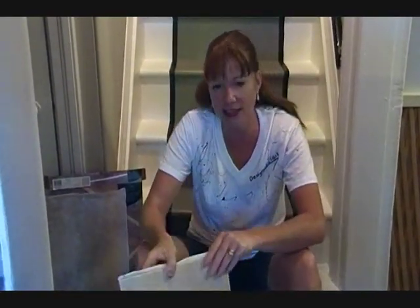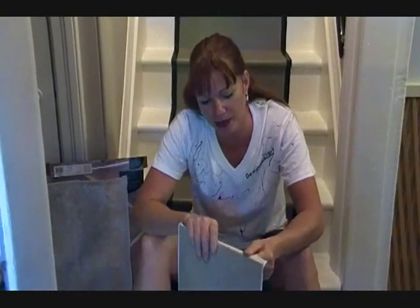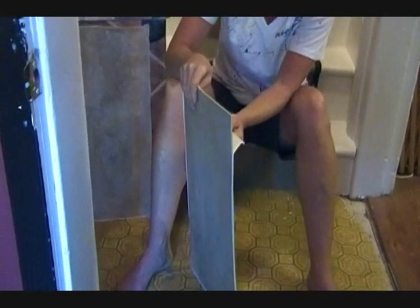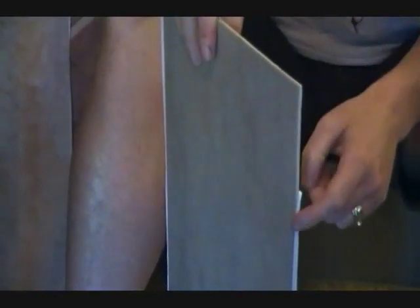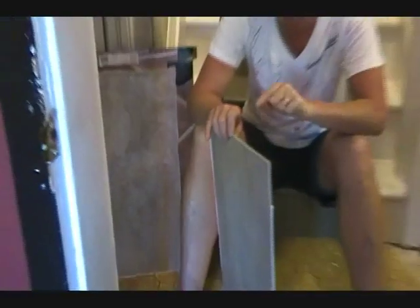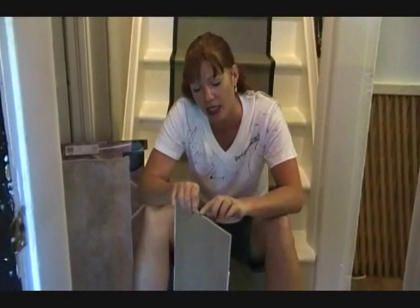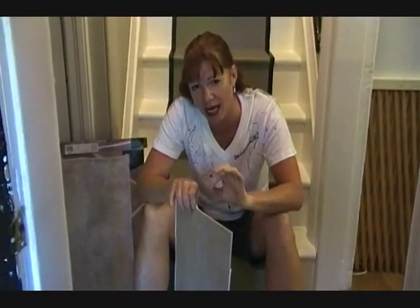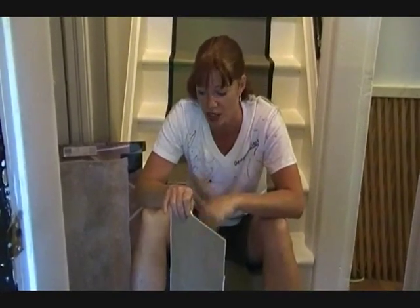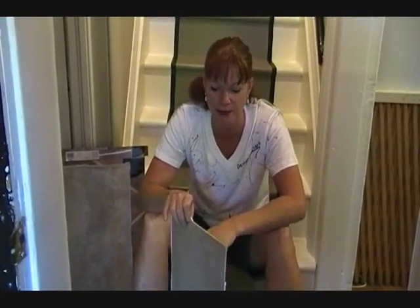These are peel and stick tile, but they're unlike the peel and stick tile of 10 to 20 years ago, in that you can see how thick they are and they have a slight beveled edge. These have a 10-year warranty, and these tiles you can either place exactly like stick tile and cut them with an X-Acto knife and so on, or you can also grout them, and I'm going to grout them. So I'm going to put them in, I'm going to have them just spaced a tiny bit apart, just enough to have a very thin layer of grout, and then they'll look beautiful, I hope.